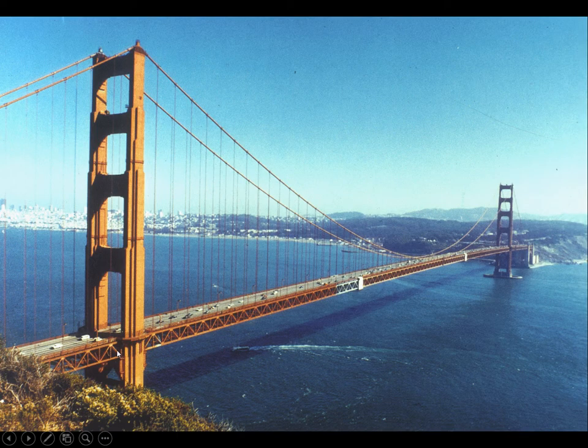This is another example. Here we have the two vertical elements that are a part of this tower. They're connected together by these deep horizontals which are moment connected in such a way as to force these things to remain vertical.